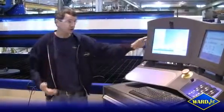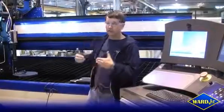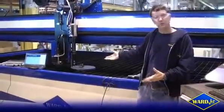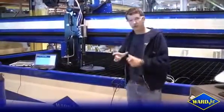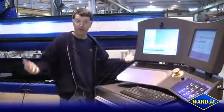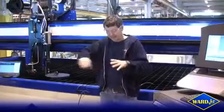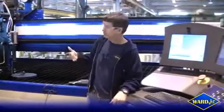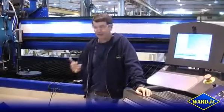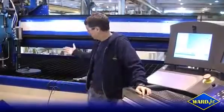Something very important is that we have remote control of the machine in the event that something goes wrong. Say somebody's loading a beam and they knock your cross beam out and now you're not getting round circles. If you have a ball bar that's a great tool, but most people don't even have that on site. You could literally cut a circle or a square, take some measurements, come into a program and put that into the formula — we can teach you how to do it, because we are very open at Wardjet. In an ideal world, take a ball bar reading and it tells us everything, and we are able to get you back to a machine literally equivalent to brand new even though it might be years later.